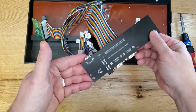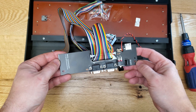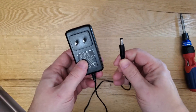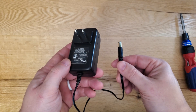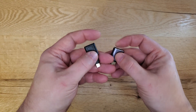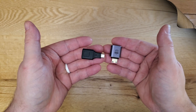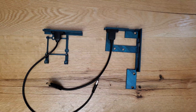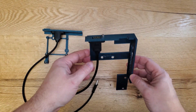If you build the board yourself you can source the parts cheaper per unit, but you'd have to buy in bulk, and I didn't want those extra parts sitting around. Past the BMC board you need a power supply, which is a relatively standard supply and readily available on Amazon. I also needed a couple of small adapters to convert the micro HDMI and micro USB ports on the Pi to full-sized connectors. This lets me run two extensions to the back of the unit so you can mount an HDMI and a USB plug — it looks pretty good and you don't have to open the case.